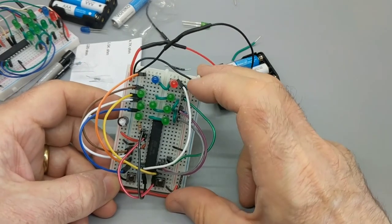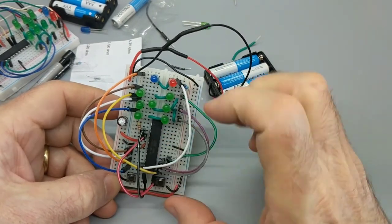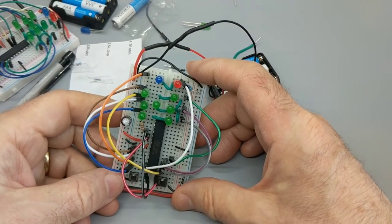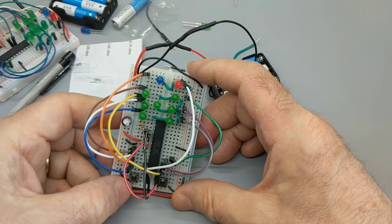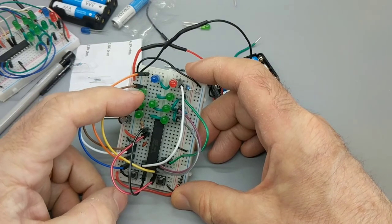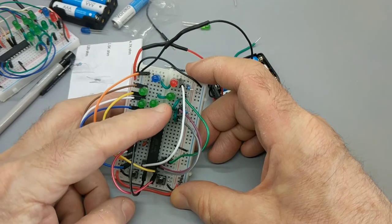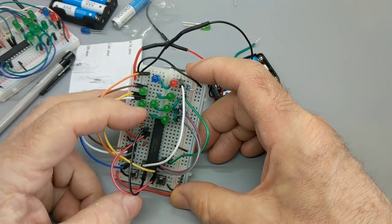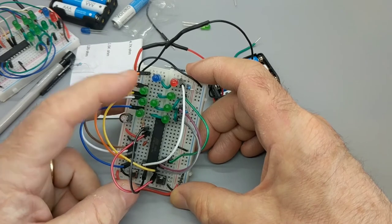that little computer right there. Let me do that again. All right, anyway, the little chip, it's got a timer built in, and it's counting down. And if you don't do anything for 20 seconds, it's going to shut off. It's going to preserve those batteries. So you don't have to do anything to preserve your battery life on this thing.